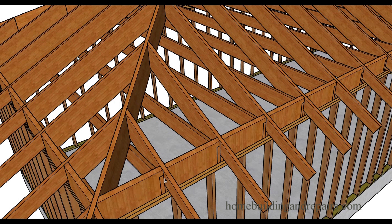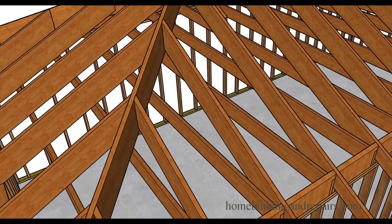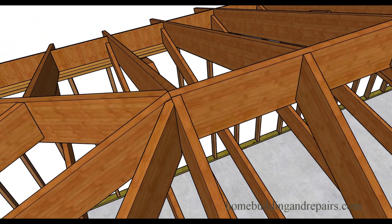The blocks go over the ceiling joist — they notch over the ceiling joist. In this particular example, the rafters are spaced 24 inches on center, 2 foot on center, same thing with the ceiling joist. If you're going to put a drywall ceiling or plaster ceiling underneath, it attaches to the ceiling joist, and they might need to be spaced 16 inches on center — keep that in mind.